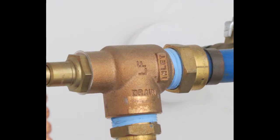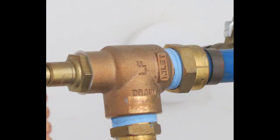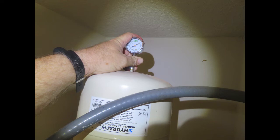This is a different type of relief system from the temperature pressure relief valve on your water heater. Some people say, 'Why do I need to buy an expansion tank when I already have a TPR valve?' Well, that valve is not designed to open and close all the time — it's designed only for emergencies. Usually if you go to test it, there's a possibility you won't be able to shut it back off because they're not designed to be operated like that. So if you have a tanked water heater, you should have an expansion device on it, properly installed.